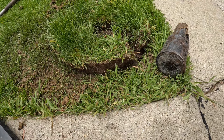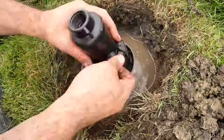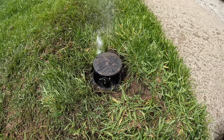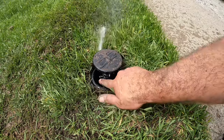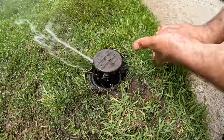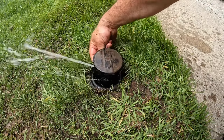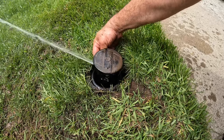Okay, let's turn it on and adjust it now. I just kind of turn the prongs to where I need them to be — the left and right. The Rain Bird sprayers are very easy to adjust, I like them a lot. On the right side of where the spray comes out, there's a little tiny screw and you can turn it clockwise or counterclockwise to decrease or increase the stream. I'm going to go ahead and decrease it a little — it's spraying too far.